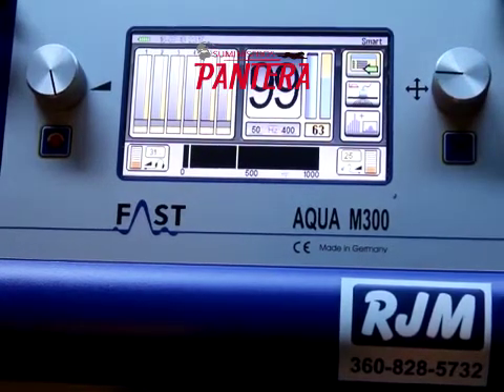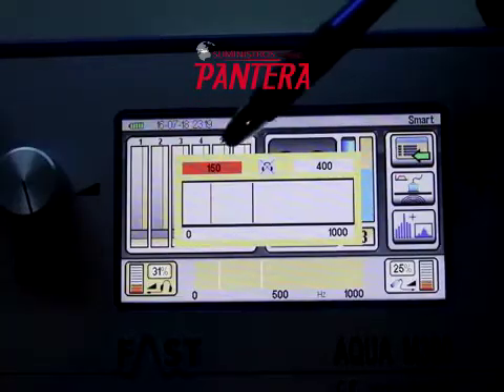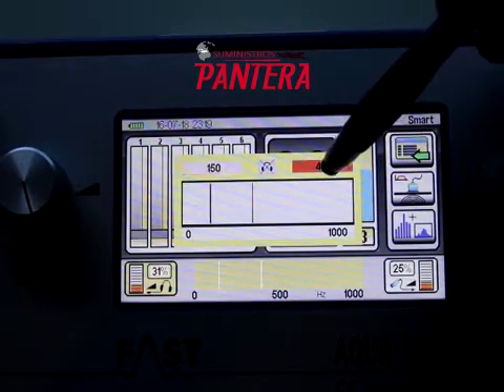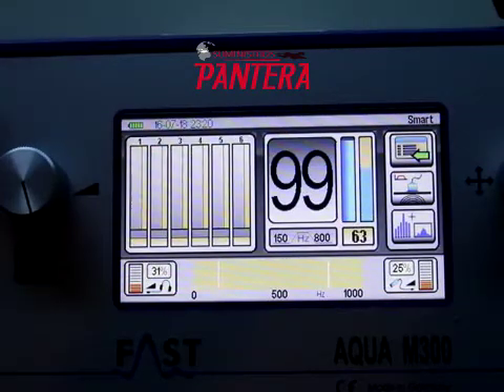To adjust the background noise filters, select the bottom center box. The filter range being adjusted is highlighted in orange. This box is highlighted when the lower filter range is selected. To select the upper range, select this box. A typical frequency range for the filters is about 150 to 800 Hz. The frequency range for your filters will vary depending on your application.